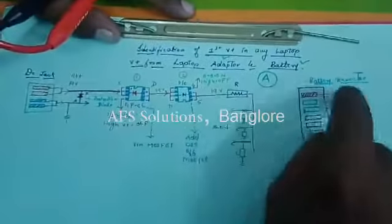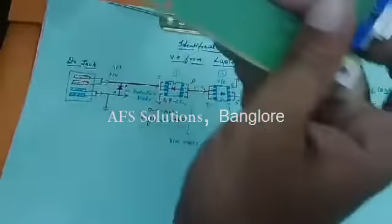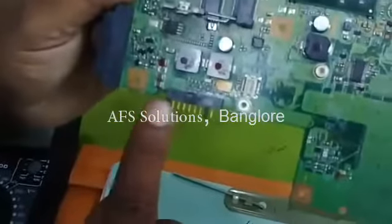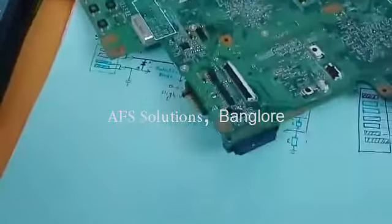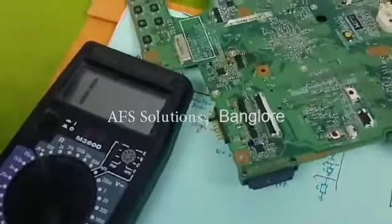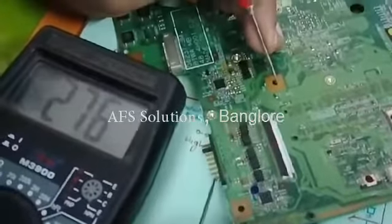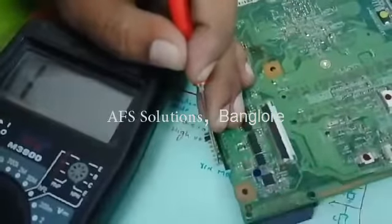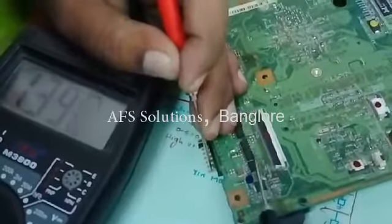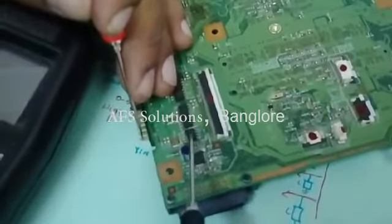From the battery connection, let us see, if you connect a battery, how the voltage will pass from BT plus inside the laptop. One end is ground, opposite end is power supply. Again, one end is connected to ground, two grounds, opposite is power supply. From power supply, let us see where it is going. It is going here. What is the proof? One, this must be a discharging MOSFET. Second, compulsory it should be a p-channel MOSFET. Let us identify how it is a p-channel MOSFET.